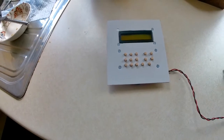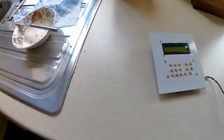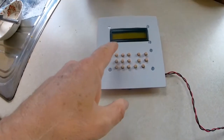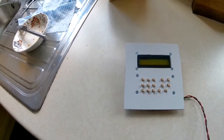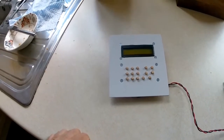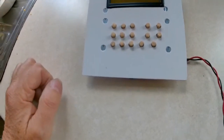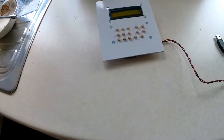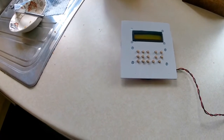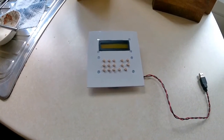It's very simple to operate, runs on 5 volts, and I think it's about 1 milliwatt RF output. I've used it on my radio — set this to 200 megahertz, set my radio to 200 megahertz, and there's a 1 kilohertz difference between the two. I'm not sure if it's my radio that's off by 1 kilohertz or this unit, but it's accurate enough for the testing I want to do. It was cheap — under 20 pounds for an RF signal generator from 34 megahertz up to 4 gigahertz. Thanks for watching, please subscribe and like.